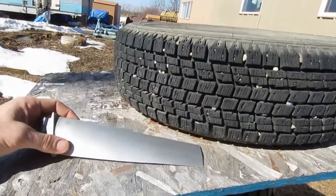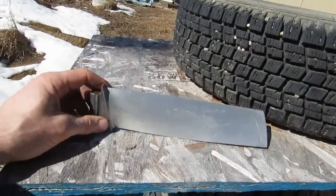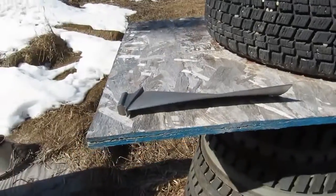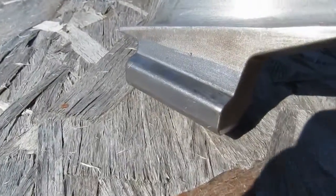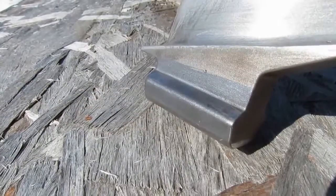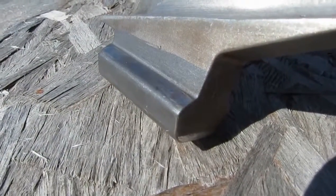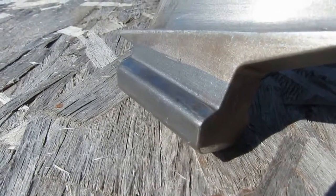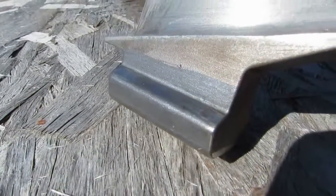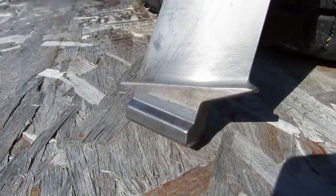Okay, we're out here in the graveyard of turbine engines with a turbine-powered helicopter in the distance to look at how a compressor blade wears out. There's two examples on this one right here. This is a stage 1 blade from an LM1500, and let's see if we can get in there real close. Okay, we're moving in here to the blade root right along there. This is the surface that bears the centrifugal load of the spinning compressor rotor, and I hope you can see there's some wear. This blade, on inspection from removal of an engine, was decided there's too much wear there, so we junked it.